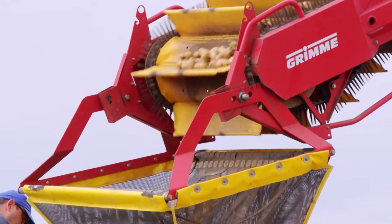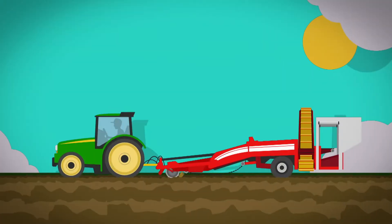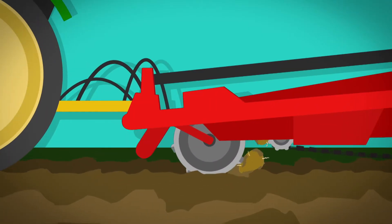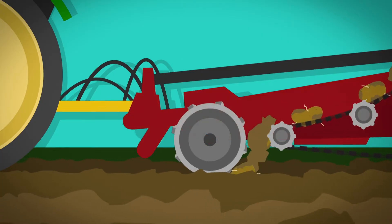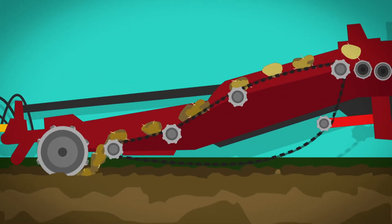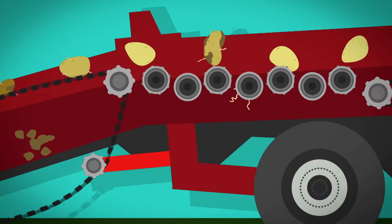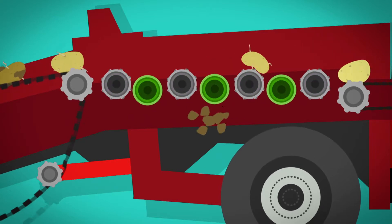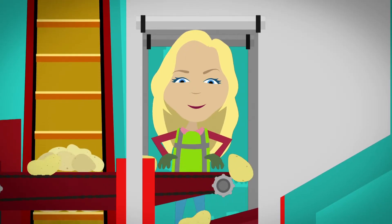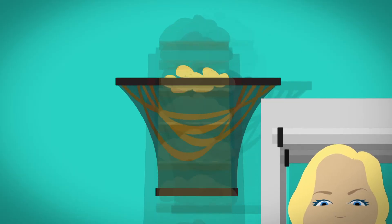And there are all the potatoes! To find out how the potato harvester pulls a whole field of potatoes so quickly, I think we should take a closer look. When the potato harvester travels along the field, the blades go round and round, digging into the ground and scooping up the potatoes into the machine. The soil and potatoes are carried up moving steps called webs. The webs have holes in them, so any soil and tiny potatoes fall through. Next, the potatoes go through two sets of rubber rollers that pull off any stems and hard lumps. The potato is then dropped onto the picking-off table, where they are checked to see if they're good to eat. The good potatoes go up in the elevator, and the fall breaker at the end makes sure they get a soft landing so they don't get bruised.